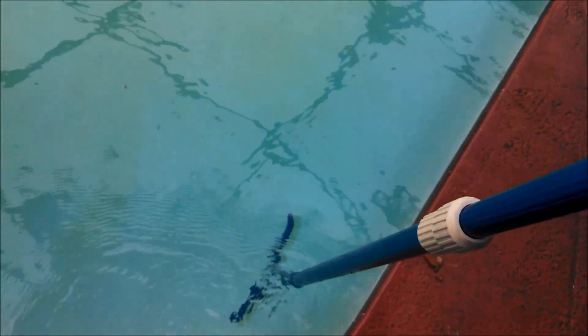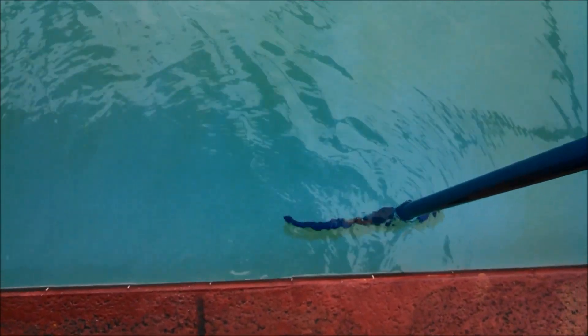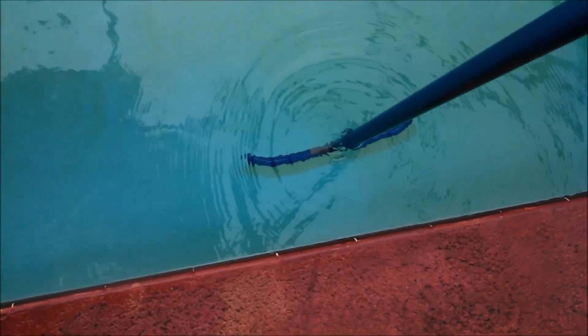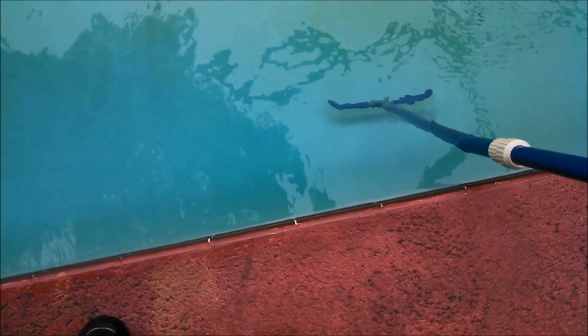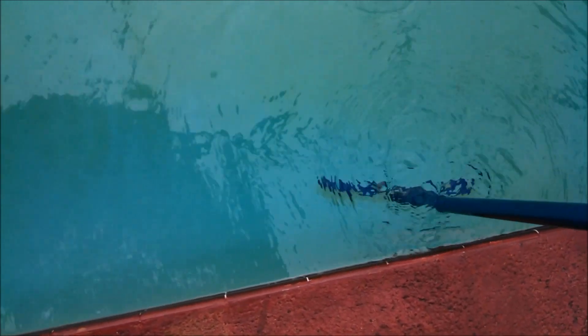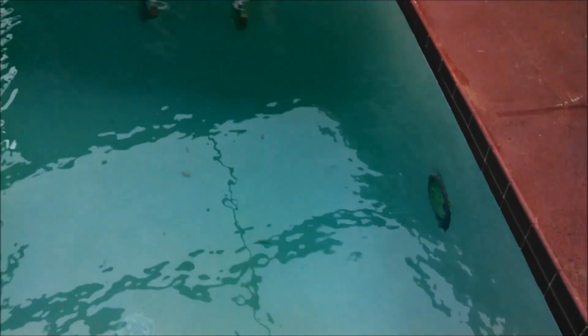I did this wall starting over here — same concept: the deep end is there and I go at an angle to push the dirt into the deep end. Now at the deep end wall, you don't want to come all the way up to the top and get a huge burst of momentum pushing down, because that kicks up the dirt. Instead, start at the top and in a very slow, controlled manner come down and hold it. If you brush down and pull back up quickly, you're just bringing dirt from the bottom to the top — you don't want that. Then do the remaining area of the wall.